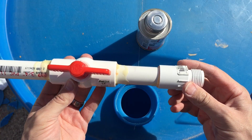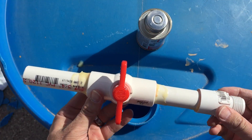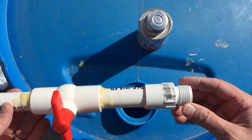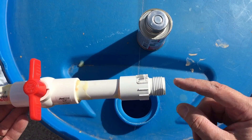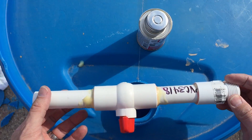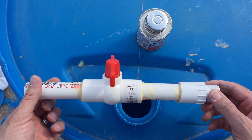Now that we've got the basic pieces glued together, we can see we've got the ball valve so we can turn that on and off. This allows the water to flow out. On the back end we're going to connect this to the bottom of the barrel so the water flows through into the hose bib. The benefit of the hose bib is that I can attach an actual hose and run it wherever I want in my yard — for gardening, for an aquaponic system, different things. That's the key.